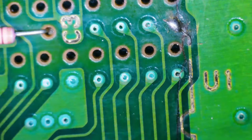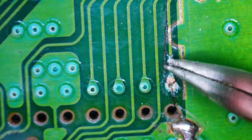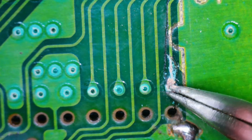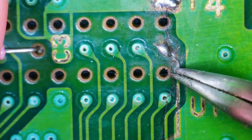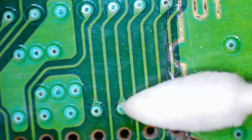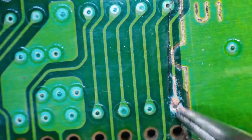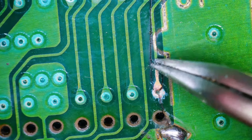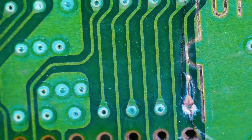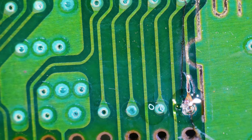So let's do that. All right, so first thing I'm gonna do is I'm gonna scrape off some more of the solder mask here so that we get a good connection. And up here, I'll probably remove whatever they got going on there. This is just a little IPA. Alright, I just put the game in a board holder. Figured that'd be better for everyone to see. And for it not to move around on me, we'll flux out on this here via.